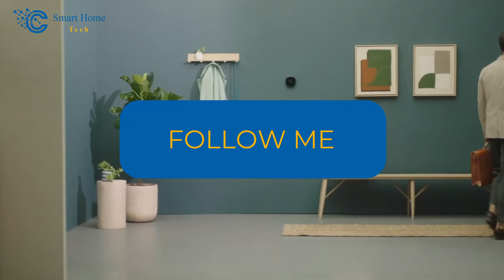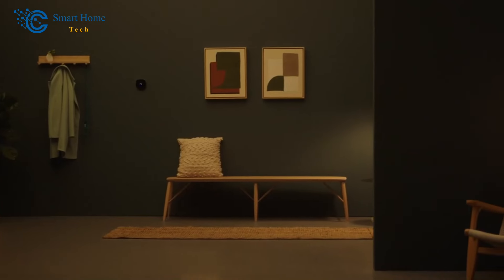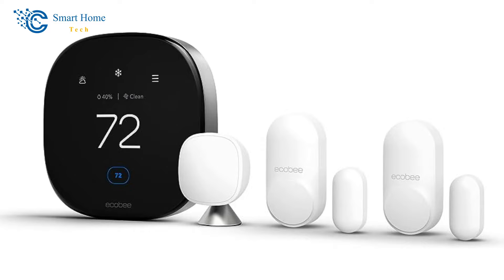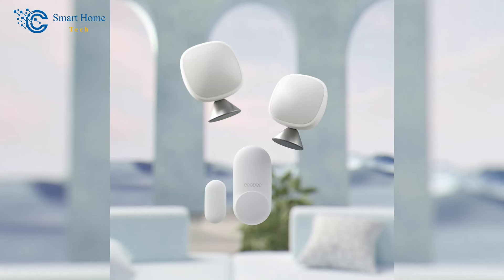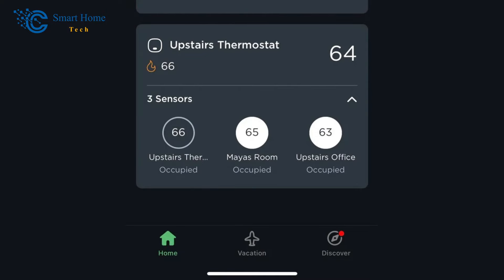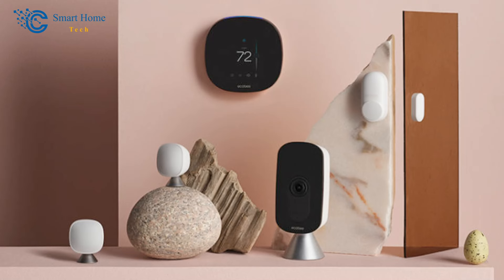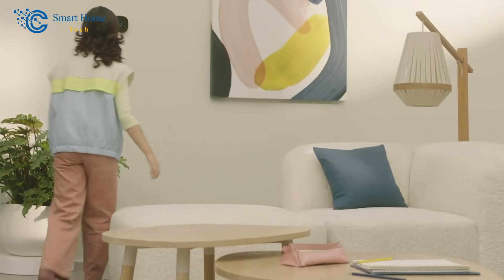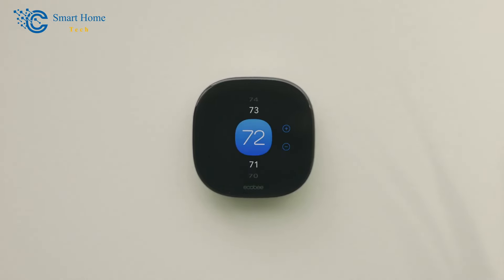Number two: Follow Me. When Follow Me is turned on, the Ecobee thermostat takes the average temperature of all sensors that are reporting activity and uses that to decide when to turn on your equipment. It doesn't immediately average all sensors detecting motion — if a sensor picks up movement, its temperature is gradually blended in, requiring detection more than once over time. This means briefly passing through a room has little impact, but settling in a room for a while will gradually be factored in. This feature is primarily designed for comfort.